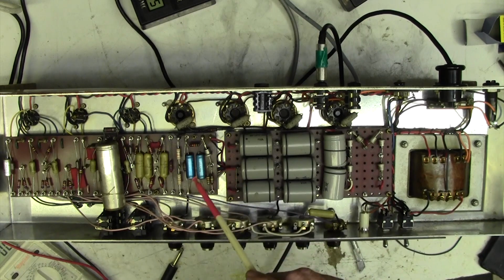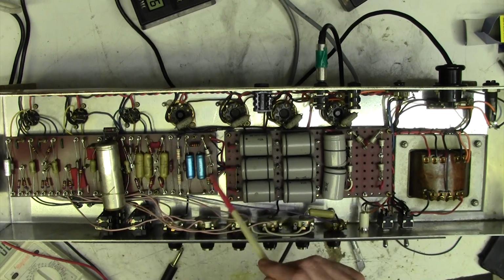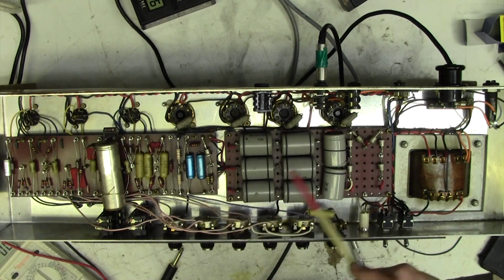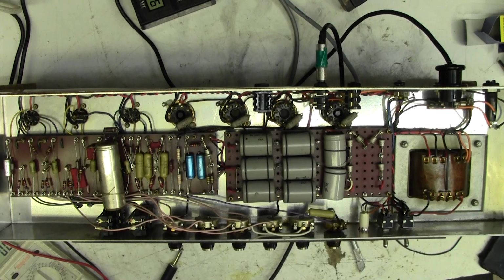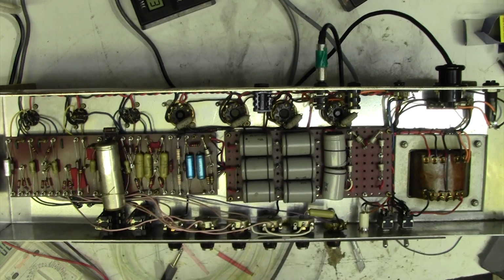I guess this is a little bit more critical, because if something happened to the negative bias, the valves would get runaway hot and eventually it would take out the HT fuse, so again, it's not the end of the world. So I'm going to get onto the client now, find out how he feels about money versus authenticity and all that kind of stuff, and he'll tell me what he wants to do. I've prepared quite a few amps for him before, so it's no drama. He'll tell me what he wants me to do, and I'll report back to you when I've spoken to him.